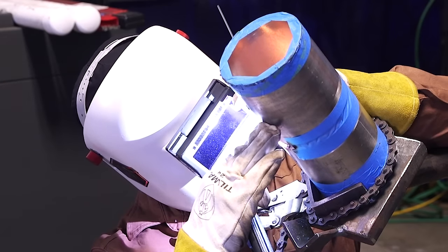With this, you don't want to make too large of movements — real small movements with your tungsten. Just make sure you get the puddle to break down your bevel edges. Getting close to our tack, slow down just a little bit, let it get a little bit hotter so you get a good tie-in.